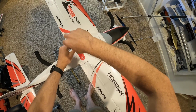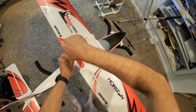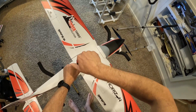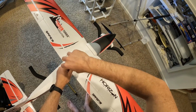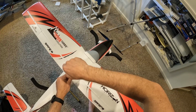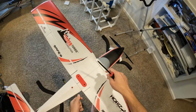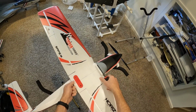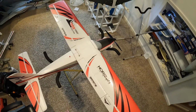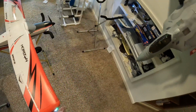If you don't do this, they're going to be sticky and the servos are going to have to work much harder to control the plane. You'll get much more fluid responses, especially with the AGF B11 DLS servos that I put in here, because this is an Avian ESC. It's kicking out 6 volts. That means that the servos, that's their highest rating, is 6 volts. And these servos kick out nearly 3 kilograms of torque at 6 volts. In freedom units, or just in terms of simplicity, 3 kilograms of torque, or 2.8 in this case, actually adds up to a ton of torque.